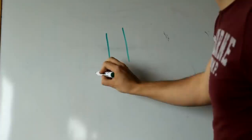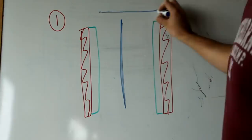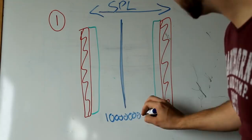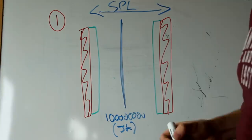This all sounds fantastic, right? So why on earth isn't the world covered in these things? Well, firstly, the SPL output is somewhat limited. In order to achieve a decent SPL, the diaphragm needs to travel a fair distance. In order to pull the diaphragm from a far resting position towards the stators, extremely high voltage is required on the diaphragm and the stators.